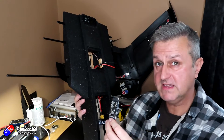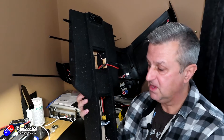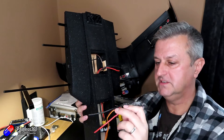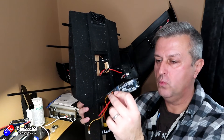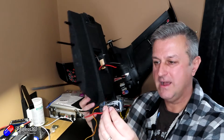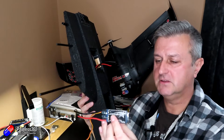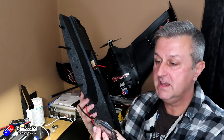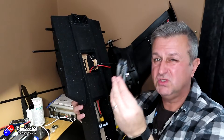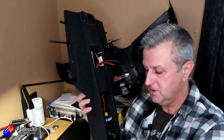There was a question about whether to use an opto ESC, and you absolutely can. Opto ESCs just tend to be ESCs that don't provide the five volts for the servos, and because the flight controller provides that five volts, you don't need it. I'll cut the red wire off this in a moment — that will stop the battery eliminator circuit from generating the five volts and will also reduce the thermal load on the ESC. A lot of the heat in these comes from the battery eliminator circuit, particularly if it's a linear one. I'm just using this because it's in my spares bin and it's actually quite a nice ESC — pretty bulletproof.